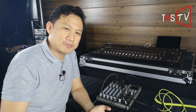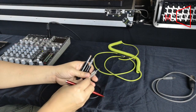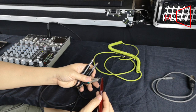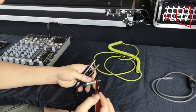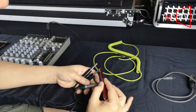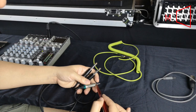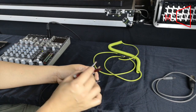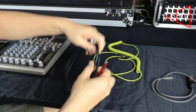So let's dig in and I'll explain what's happening. We go back to the properly made connector. The properly made connector has left, right, negative. The way it's wired, it goes to the left positive, right positive, and the sleeve goes to the sleeve of the connectors. That's the way to do it — left, right, stereo. You bring the signal to the mixer in stereo. That's why the sound comes out clean and proper.